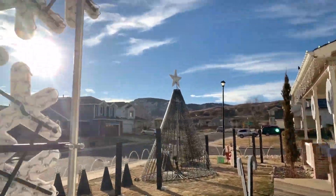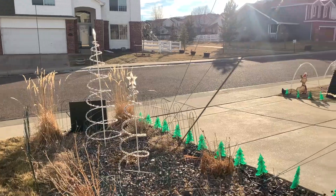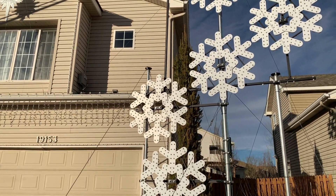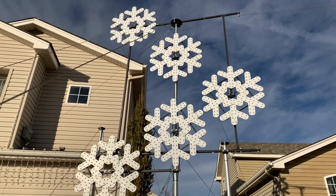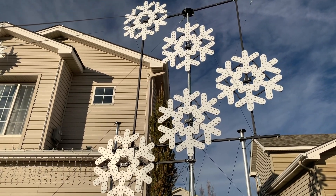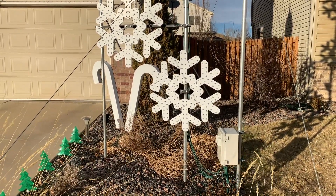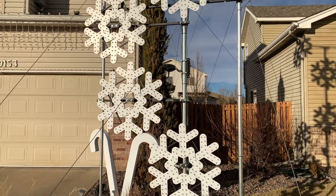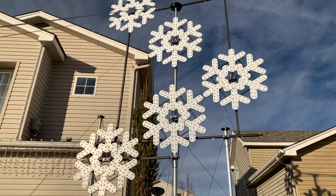That's pretty much it. Hopefully this video has been helpful in giving you some insight on the design and construction of the snowflake tower. I don't think it's as complicated as it appears to be. As a review: we have the ASAP pole in the center, and then the two outer poles help distribute the load and weight of the tower down to the ground. I have the frame on the upper section to help stabilize that, and the snowflakes themselves have the mount behind them and just bolt to either the frame or to the pole using the muffler clamps. Next year I hope to do a time-lapse video of this to help you guys visualize how I set this up and take it down — so look forward to that next season. If you have any questions, please leave a comment and I'll do my best to answer them. Thank you.